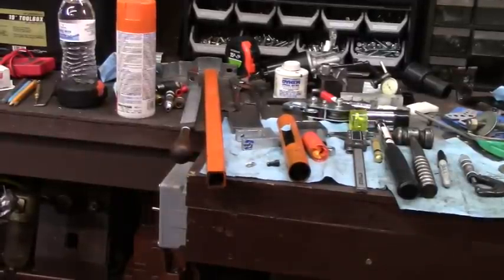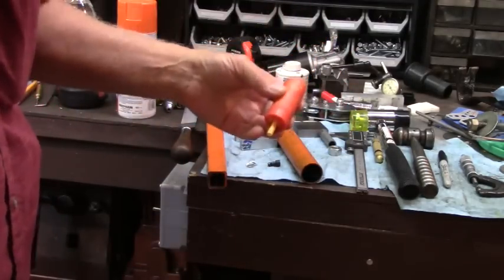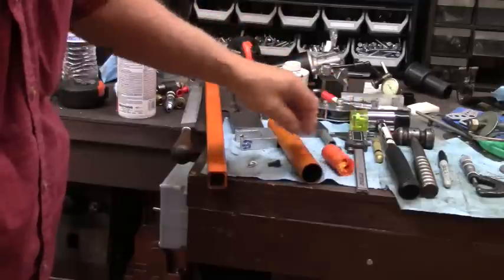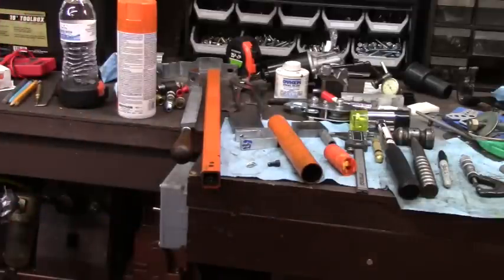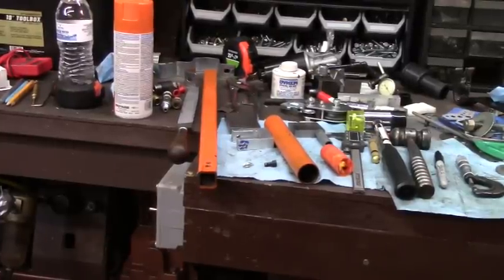Okay, so I shortened the tube where the plastic's melting, cut this much off of it. This was what was left over from the last time. And I'll probably just dump that right back in there and melt it again. And I replaced this with a longer support because we're going to go to the air cylinder instead of a lever. I think the air cylinder is much better. It's just a straight down force. And it'll always come all about this short of the bottom. But, you know, it doesn't matter if there's a pile of plastic left over in there. You just melt it and go on with it for the next thing. So let me get things a little bit more organized and we'll try to hook up air.